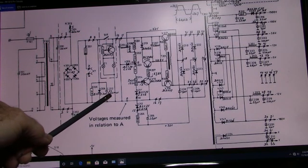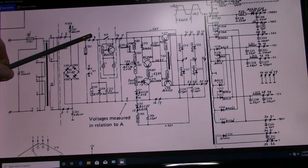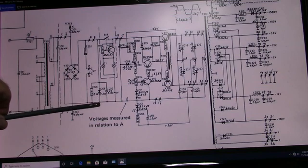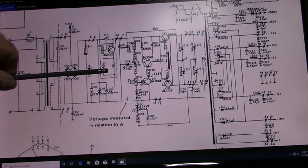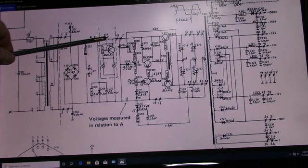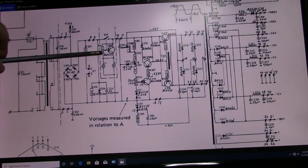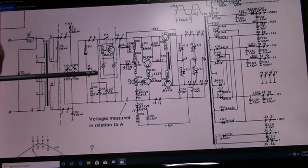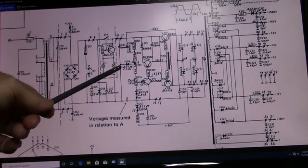It's a large capacitor here. Was it 2350 microfarad? It charges across the two rails here. This is probably a bleeder, and this transistor here is for the graticule illumination. When you close the circuit, the main switch, it also goes to this pot, and by controlling this pot you control the current through the two lights on the graticule illumination here.